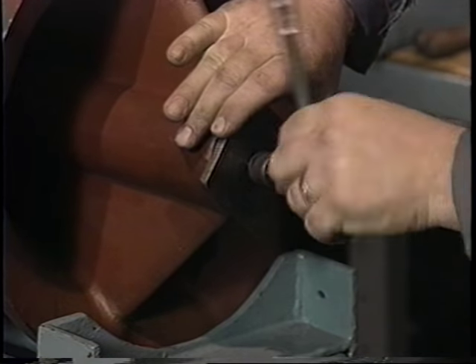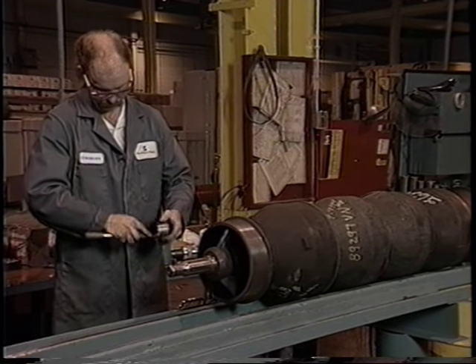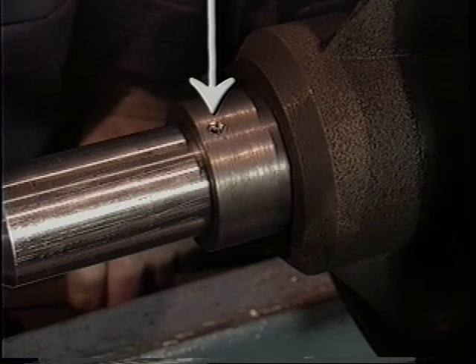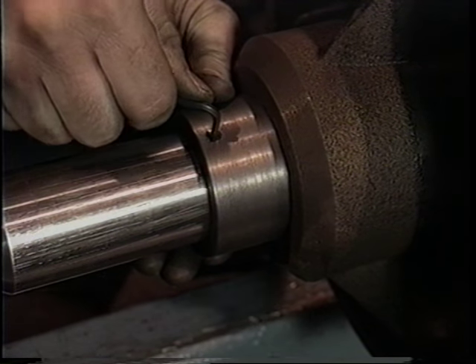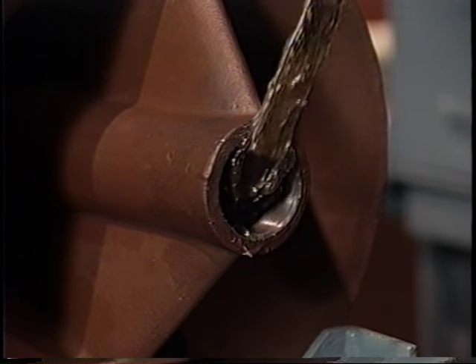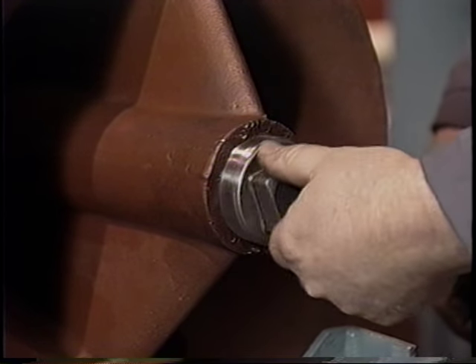You can now remove the tie-down bolt from the bottom of the shaft. File the interior of the second sand collar and verify there are no burrs inside. Place it on the top of the shaft and slide it down until it rests against the top bowl, with the end that has the set screw pointing away from the top bowl. Tighten the set screw to fix the sand collar into place. Verify that the shaft moves freely in its circular and lateral movements, and push the shaft down as far as it will go. Returning to the bottom of the pump, fill the cavity in the suction manifold with water-resistant grease — this will be the only lubrication between the bottom bearing and the shaft. The other bowls do not need grease because they are water lubricated.